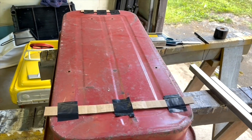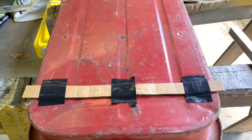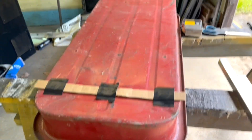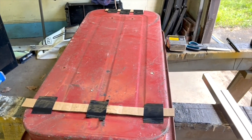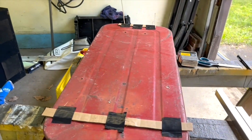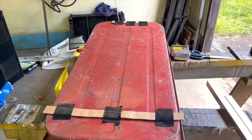I'm not sure how long I'm going to go off the front, but we'll tackle that. I made templates — all I did was trace the pieces I cut, which are sitting right here, onto cardboard. I measured, got them all centered, and taped them down. Then I'm going to flip the wagon over, mark the holes, and lay those templates directly on the pieces of metal. That should give us really nice alignment.